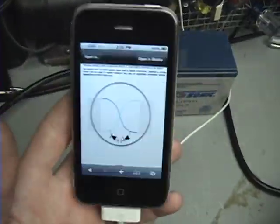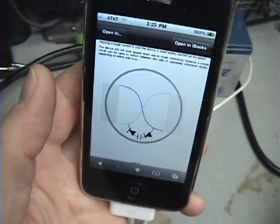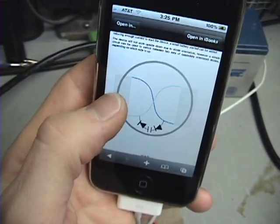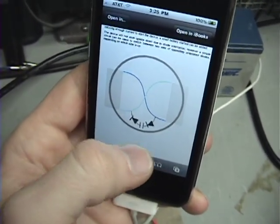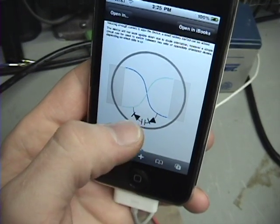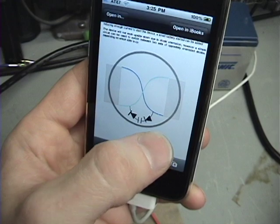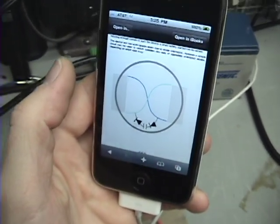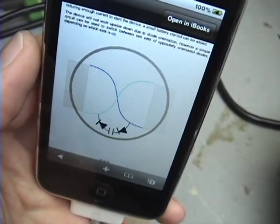Here's the schematic. I can only get it to charge a cap and then stay charged and then discharge through the meter. Basically, the TPU is the ring there, which would be my horseshoe and my top plate. There is a coil here and here, and the wires go different directions for your north and south polarities. You have two diodes and a capacitor between those two. You're basically cutting out one wave to charge your cap. It doesn't tell whether it's electrolytic or not, polarity, I don't know.